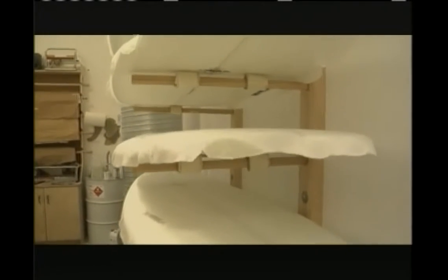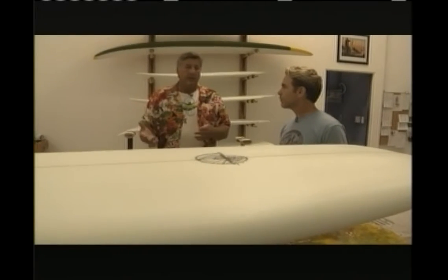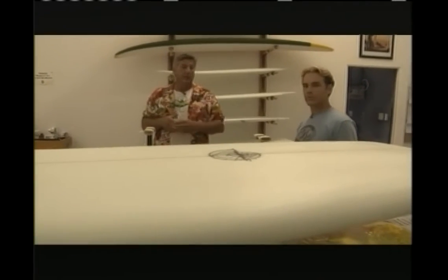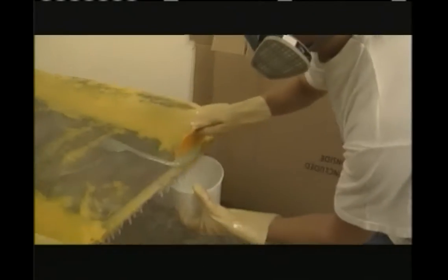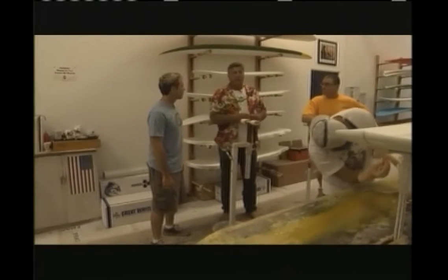Okay, so the resin that Micah put on the board is like the glue that's going to glue that fiberglass cloth to the foam core. This glue that he's using is called epoxy. Epoxy's fairly safe to use, doesn't really put any toxic fumes into the atmosphere, but this is a far safer resin than the average surfboard resin, which is called polyester, which has styrene, and it gives off toxic fumes to the environment, and it is bad for the guys that are working with it. And then if you remember, the board we had in the other shop had linseed oil as one of the resins. We've also used some resins made out of soy. So there are some plant-based resins now too that are available. You said linseed oil? Any plant that puts out oil, that oil can be converted into some sort of glue, whether an epoxy or other types.